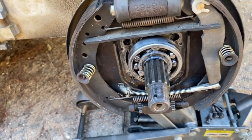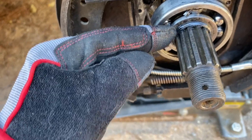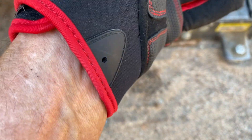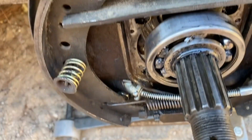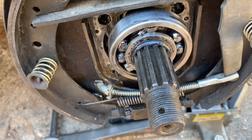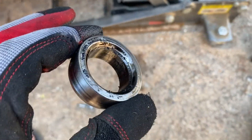I've got the bearing pulled out — it came out really easily. You can see there's a rubber o-ring that was compressed inside this spacer. See how this has a beveled edge — there's also a little washer with a beveled edge that fits over that o-ring. So that's part of the seal system and you want to get that back together the same way. This is going to need some cleaning up.